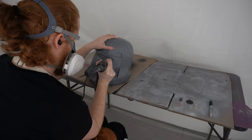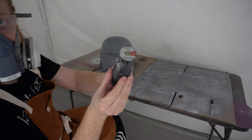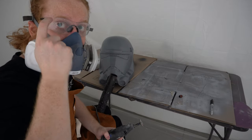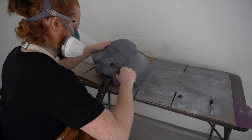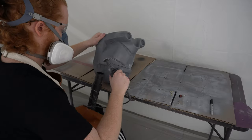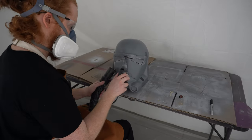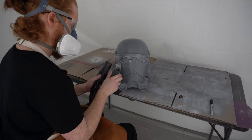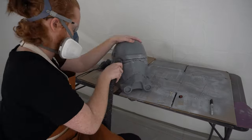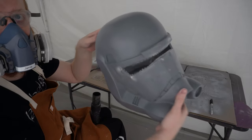Right. You kind of just want to connect the dots to those holes. It helps make the cutting wheel a lot easier to use, and you definitely don't want to have a stray run of the cutting wheel and accidentally cut something that you don't want to. Those dots and those holes really help keep things in line. And so when you're done cutting that all out, it should just fall out, and then you can refine any edges with sandpaper or a file.